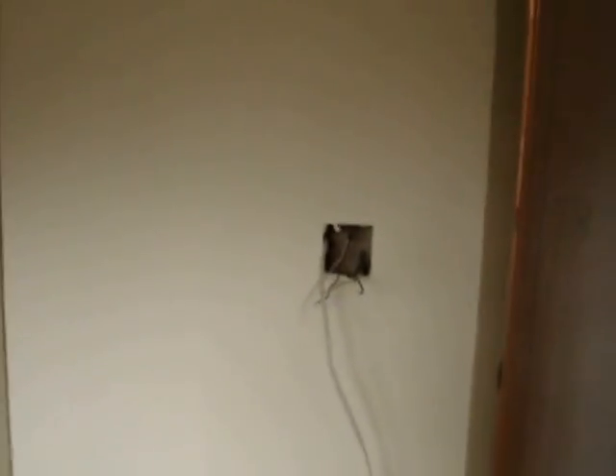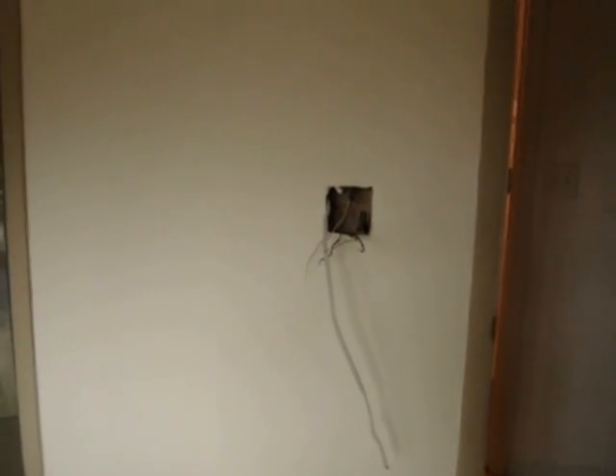There's the hole, and yes — there's the wire we sent down. I always send down plenty — that's more than enough. You can see the wire I dropped easily went right through the hole, so I knew I had that right. Now we've got the hole cut to double-box size. We can put the box assembly together, go through the wiring, and we'll have a new black and white wire going up to the light — giving us one switch for the light and one switch for the fan.